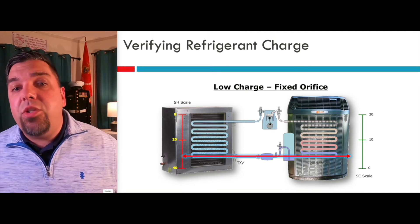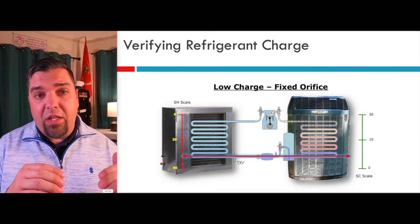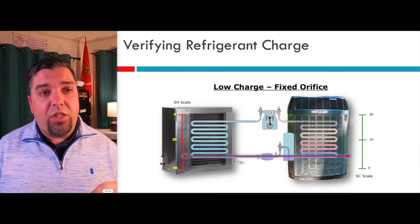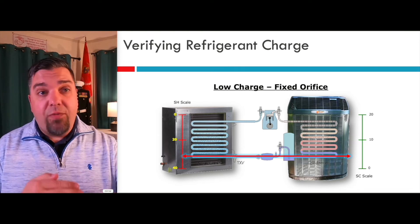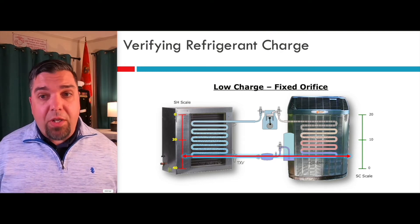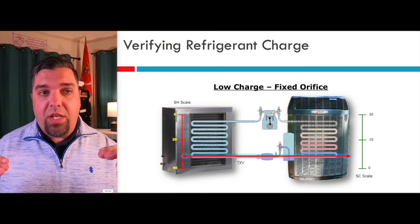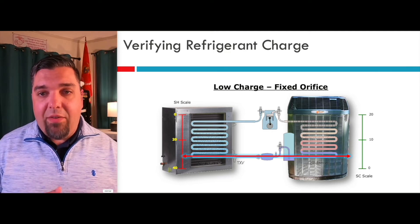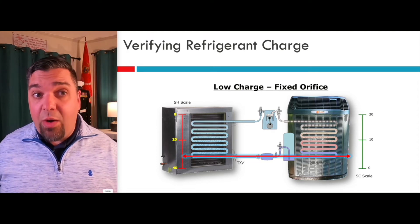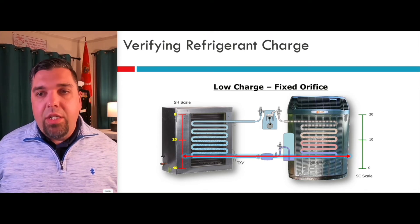Let's look at what it looks like with a fixed orifice when it's undercharged. Because you have a fixed orifice instead of that valve, it's going to flash off really fast because we're not stacking up any liquid in that coil, and it's going to have a really high superheat because we're picking up heat after it flashes off past saturation. We could have as high as 30 degrees of superheat and really low subcooling. As I add refrigerant with that fixed orifice, the superheat starts to go down and the subcooling starts to rise — getting closer to a balanced system. I'm watching both the superheat and subcooling as I add refrigerant, because if subcooling goes up really crazy, I've got other things going on. I can't just get the superheat right and overcharge the unit and kill a compressor. You have to look at both sides of the system.